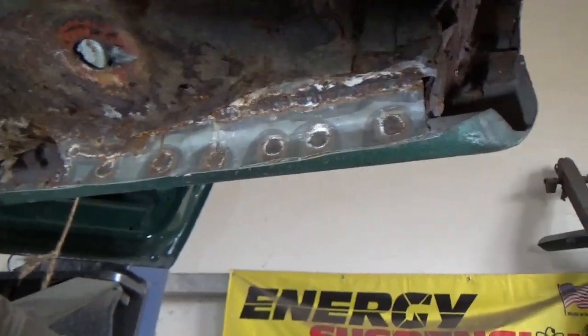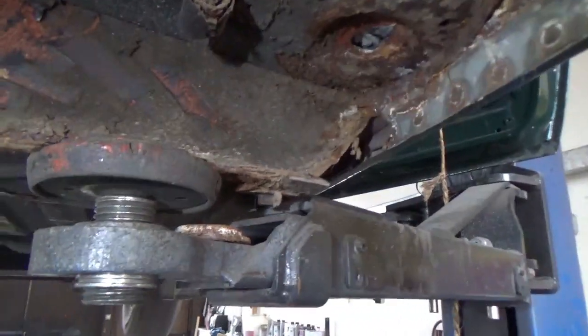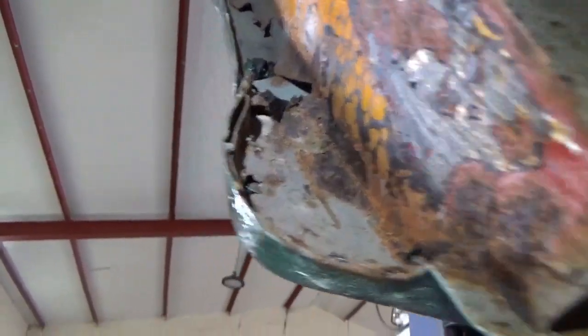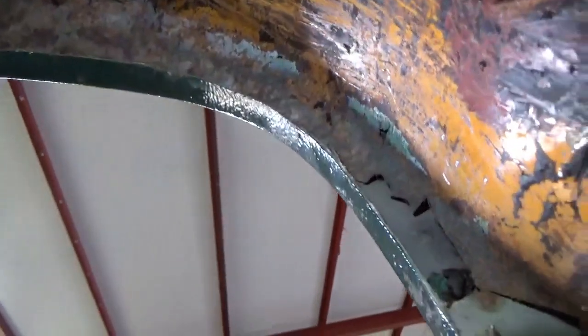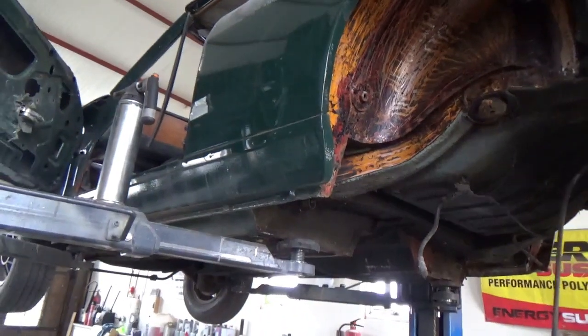As you can see, there are a few more quality repairs there that need to come out. The heel boards are very good. There is some rust on there, so until I've wire-wheeled that off I can't be sure whether that needs any repair work or not — I don't think it'll need a lot, even if it does. Same on this side. Again, inner wheel arch not repaired correctly, or indeed at all. Actually they've put outer wheel arches in, and the outer wheel arches are very good so they're going to stay. As you can see, there are holes around the edges of that, so those need replacing.